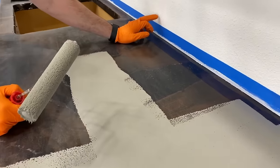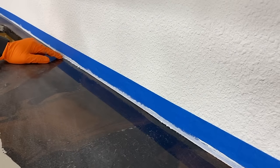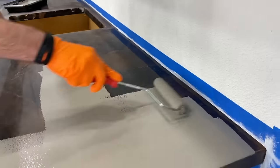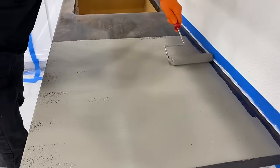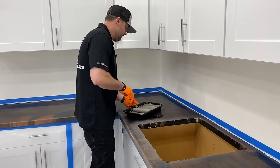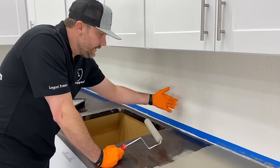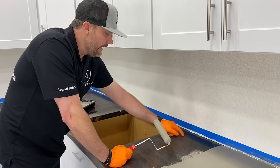Since we don't have a backsplash, we just taped the wall and then took the same paint color and brushed it over the tape — that seals it so we don't get any bleed from epoxy or primer on the textured wall. Cool little trick: when you want nice crisp lines, just paint over your tape with the same wall color and that'll seal up any spots that would bleed. If you have tile or glass backsplash with grout, tape it and use clear latex paintable caulking run along the tape to seal it as well.